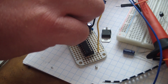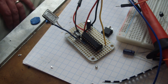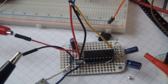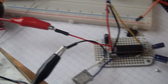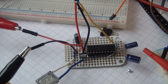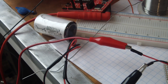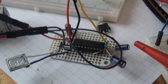One thing I didn't add was input protection, so if I get the polarity wrong it's going to fry it, which is bad. Anyway, it doesn't sound very happy. I got it in test mode on the batteries. I added some caps there just for shits and giggles — sometimes you add something, sometimes you take something away and it works. It's not working on a single battery, so I put it on the power supply — 5 volts and about a million amps — and now it's working. So I think the problem is we need more volts. I'm going to series these batteries — instead of just one, I'll have two in series. Now I've got two batteries with the positive running to the negative of the other. Working like a charm.